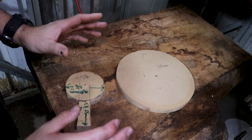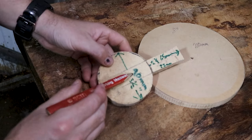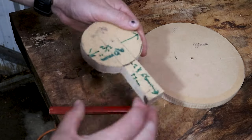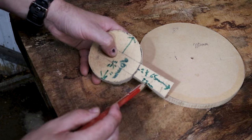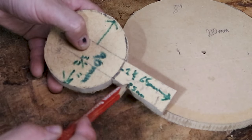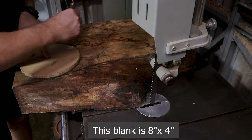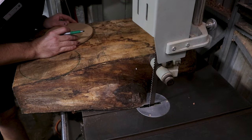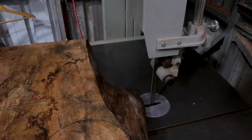What I've got here, as Mike shows in his video, is a little template like this. It is 90 mil in diameter — so three and a half inches — and you can see the cup shape there. The handle I've made is two and a half inches or 65 mil long, 25 mil wide — an inch wide for the little handle. Before I cut this out, I'm just observing, looking over the top of it, checking for any severe cracks. But this piece of mango looks really nice.